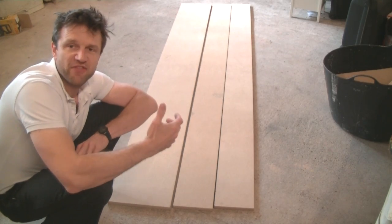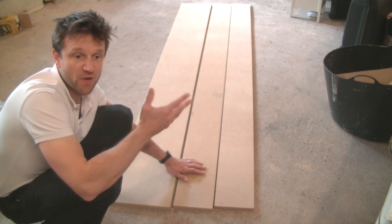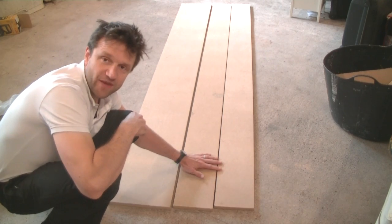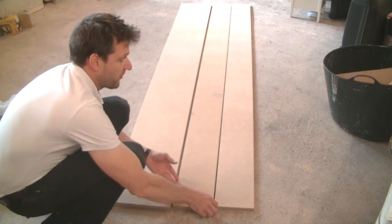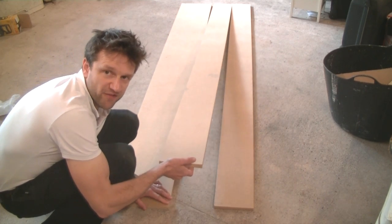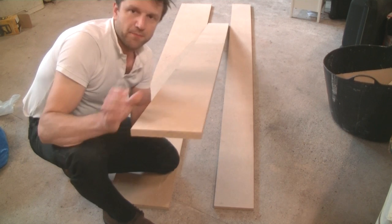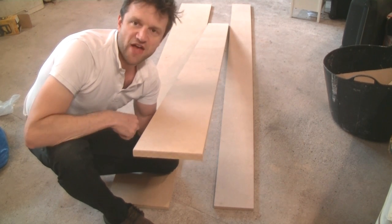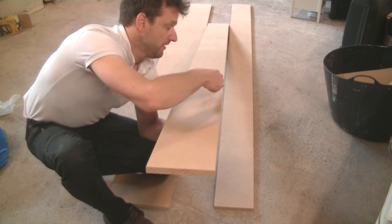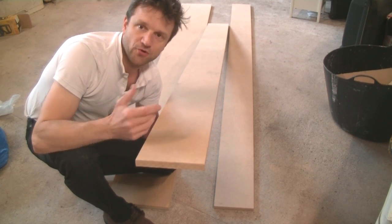The benefit of drawing everything out like this is you can then go to your hardware store — B&Q or a timber merchant as I do — and get the sheets of MDF cut into the strips you need, because cutting long strips is quite difficult to do at home if you don't have a decent workshop. Once you've got those long sheets cut, you can use a saw and a plane to do the much easier shortcuts to make your drawers, cupboard doors, or whatever you're making.